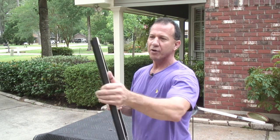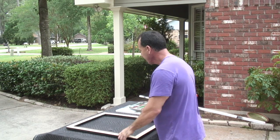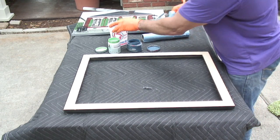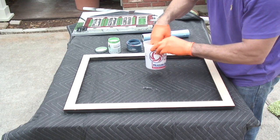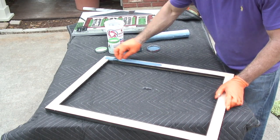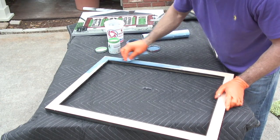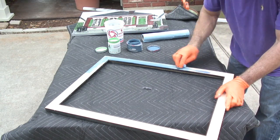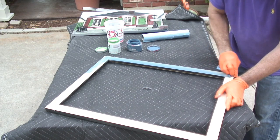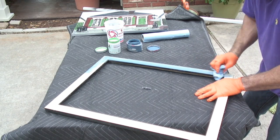My truck bed paint is dry and now I'm ready to finish the front. If you get a little bit of overspray on there, just take 120-grit sandpaper and knock it off. This is only going to take a couple of minutes. I just take a rag with a tiny bit of water — you just want to dampen your rag a little bit. So I'm going to take the blue first; I might not even use the green. When I rub it on, I'm going to come back over and rub it back down and it's going to show the green. So just wet it a little bit and rub it in. I'll probably just go with the blue — I think it's going to look fine. Then you just rub it a few times and wherever you have grain, the grain will show up.